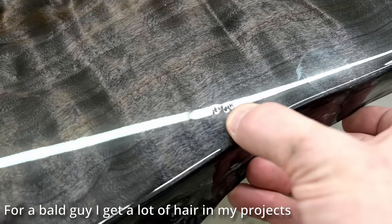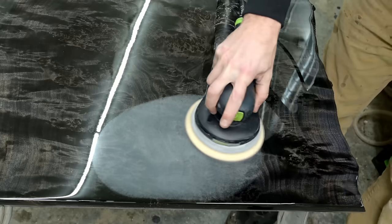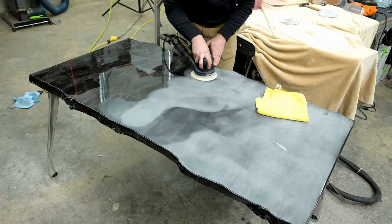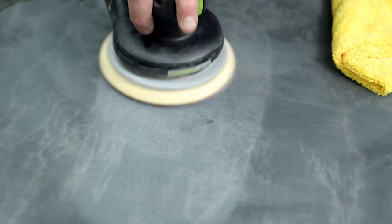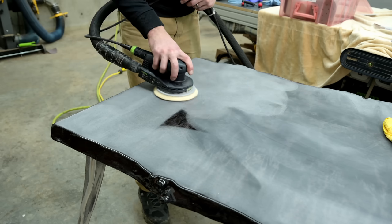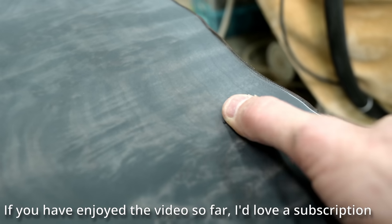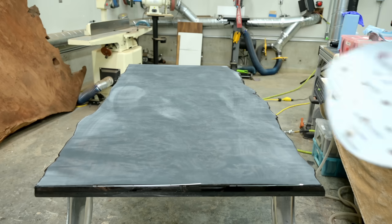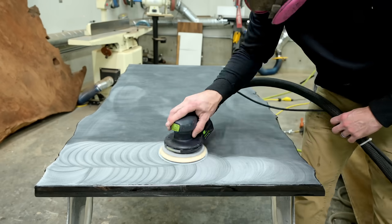That last epoxy flood coat actually went pretty well, except for two little hairs that landed in two different spots. I didn't realize how much of an impact those little hairs were going to be — I ended up having to go all the way down to 600 grit sanding. I was hoping to go right into 1500 grit, but to get those hairs fully removed I had to remove quite a lot of material, which leads to a much larger problem. Before you lose all respect for me, I should probably ask for your subscription now — before you actually see that mistake. If you've enjoyed this video, learned what to do or what not to do, or just enjoyed watching me struggle, I'd really appreciate it if you hit that subscribe button. Just don't hit unsubscribe once you see the mistake I made.